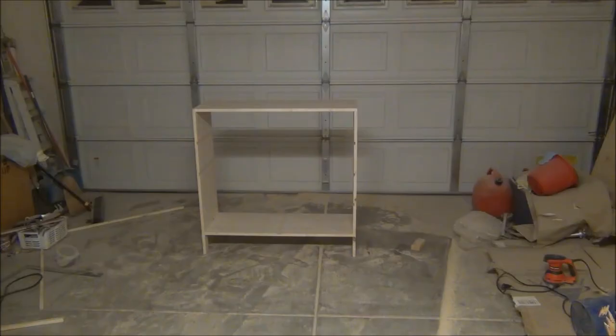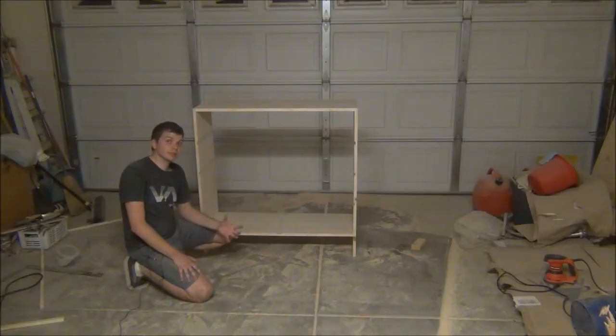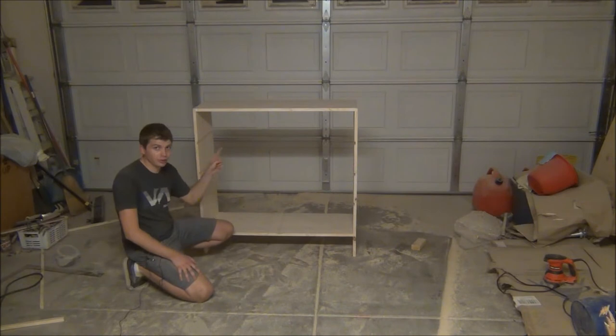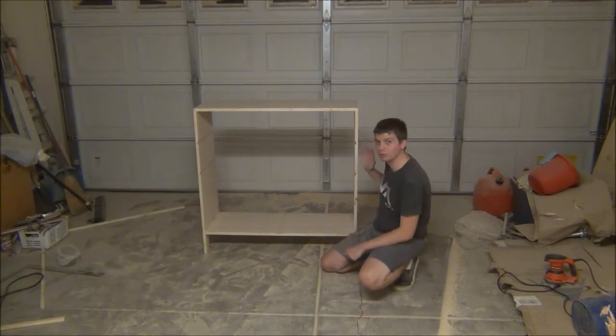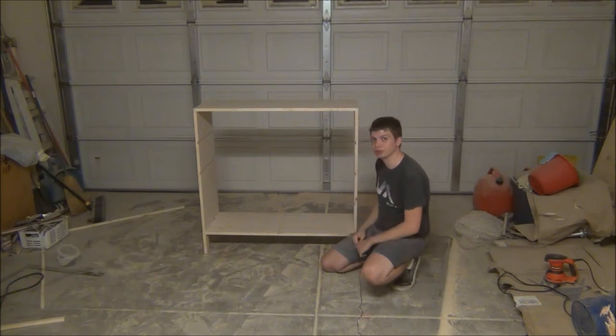With all the channels cut, I'm now going to go ahead and give the inside of the cabinet a thorough sanding, because it'll be difficult to do that past this point. Next, I'm going to cut out four 2-inch wide plywood strips to serve as a face for the front of the cabinet. I'm going to glue and nail it down like we did the body, but I'm also going to dowel pin the corners to make sure it's as strong as possible.